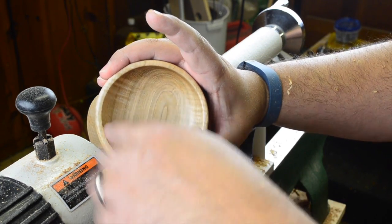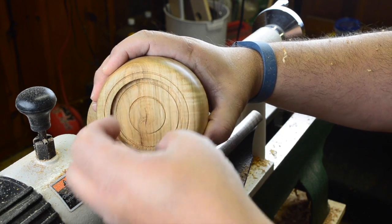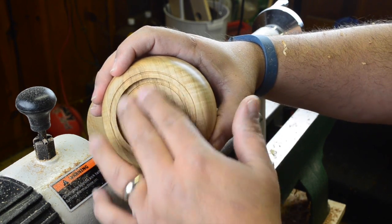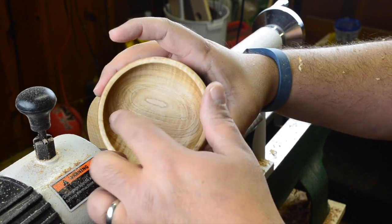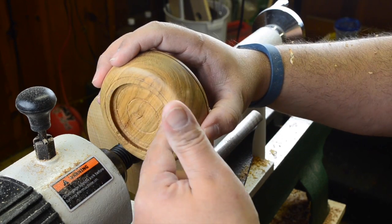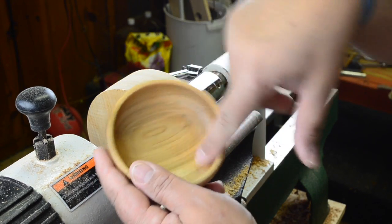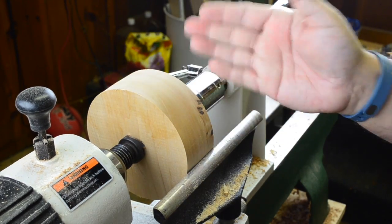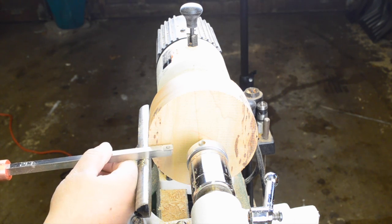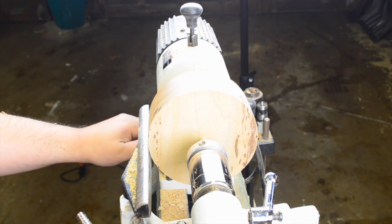I'm really getting close to taking care of the interior of the bowl — to start removing the material — but in order to do that I want to create a recess into which my jaws are going to sit and hold it, so I can get rid of the tail stock and then start removing this portion. The way I ended up doing this is I created a tenon on one end, attached that into my jaws, had it clamped down, removed the material, and then flipped it around. Now I'm going to create that tenon on the portion that will actually be the bowl itself. We'll create a tenon big enough to have the jaws clamp onto it and then we'll go from there.